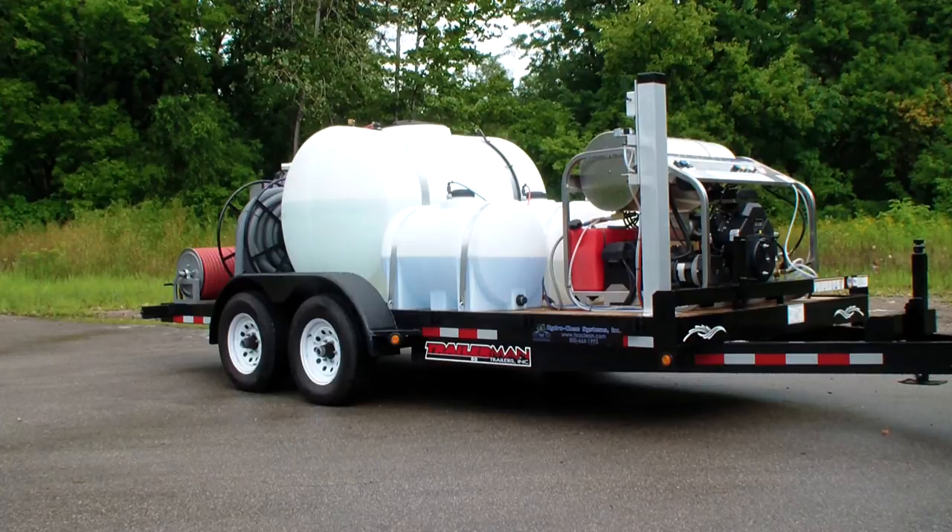It's got a 150-foot capacity vacuum hose reel with a hundred feet of two-inch vacuum line going to our wastewater recovery and filtration system on the back of the trailer. That actually has a six-stage filtration system that can be pumped back to the tank or discharged to a proper disposal area like a sanitary sewer. I also have an 18-inch manual hose reel on this trailer with 150 feet of three-quarter inch inlet hose.